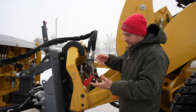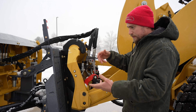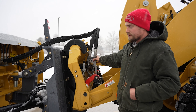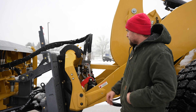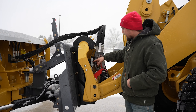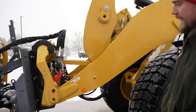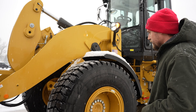It's cold at night — you don't have to twist or push your connections on. They might be frozen; if they're push-ons or twist-ons, you might have to get a wrench and tighten them up. When you're plowing they vibrate loose and then it pulls the seals out of the couplers. We've been running these for three years and have never had any issues — they are absolutely fantastic. You have your two hydraulic lines that operate your plow and your electric line that operates the valve for your electrical hydraulics for the wings, operated by a rocker switch in the cab.